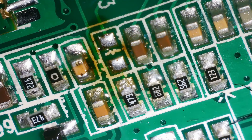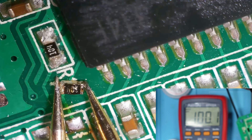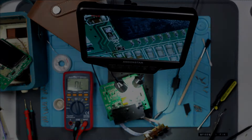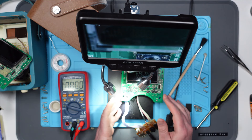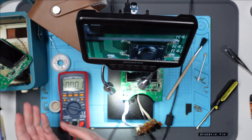It's an interesting way of removing it. Right, let's see what it's measuring now, out of circuit: 100.2 kilohms. So out of circuit it's reading fine. This is really bizarre. So I've been following the 2.6 volt rail — the one that's reading 3.3 on the working one.